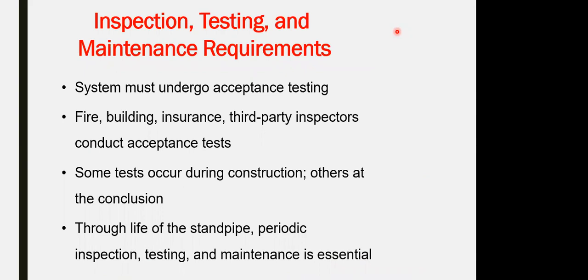Right. So for the kind of questions on this topic, I think we covered the first part: the definition, the applications, the use, the pressure, the GPM, the flow, and the types. We covered all of this. The second part of the exam comes for testing, commissioning and maintenance. For all sections of NFPA, the first chapter is general: introduction, definitions, and after that the systems and components themselves. For the sprinkler types, the standpipes, the components, the valves, the operation and categories, the selection, the sizing. The last part of the NFPA within the section is covered by testing, inspection, and maintenance.